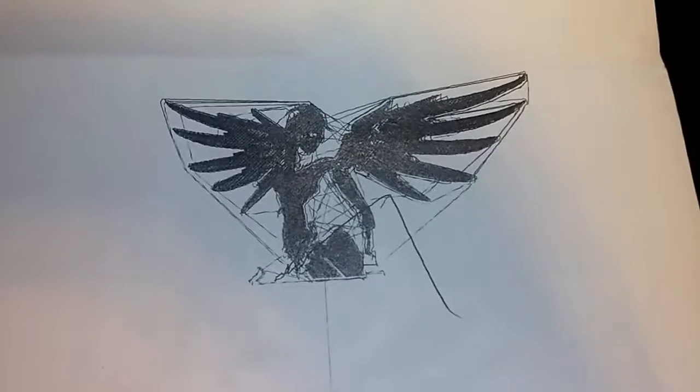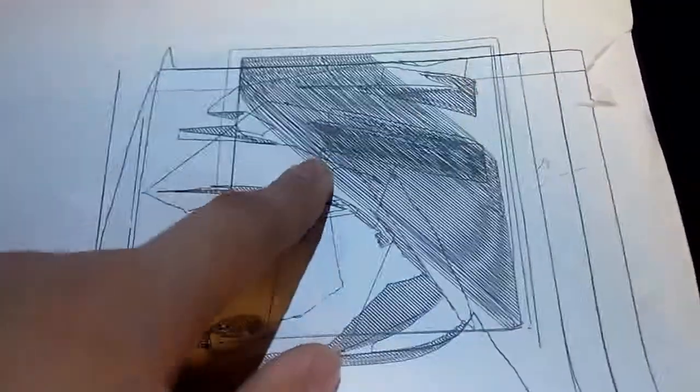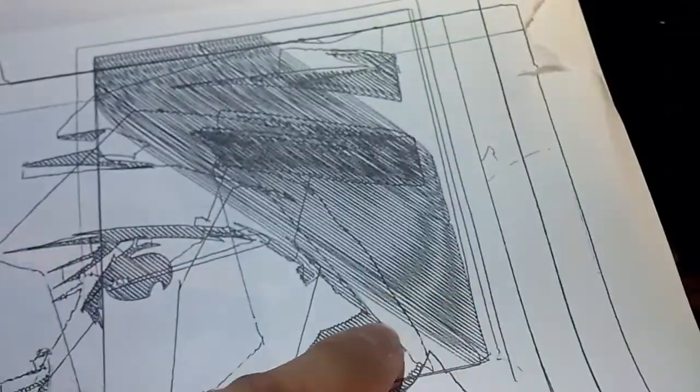After that I was like, this is kind of viable, what else can I do? So I made some test prints. I tried the same image in a different slicer program and it was just drawing a square. I thought it was doing fancy circles and that somehow the G-code maker was smart enough to intersect and create the image — but it turns out my tape was just very loose on the pen and there was way too much pressure on the Z-axis.